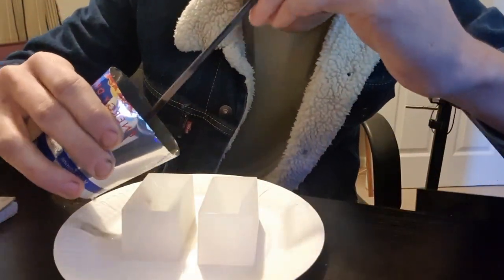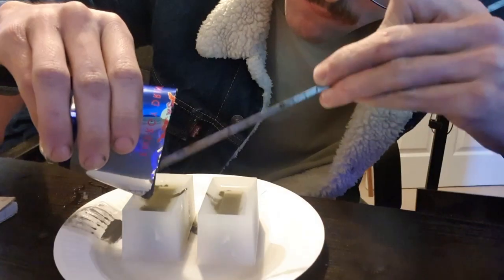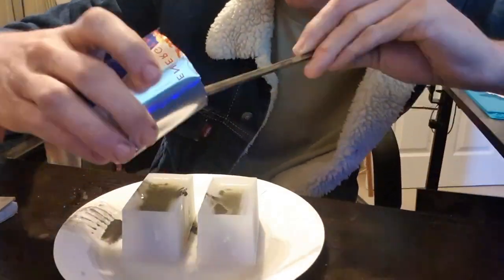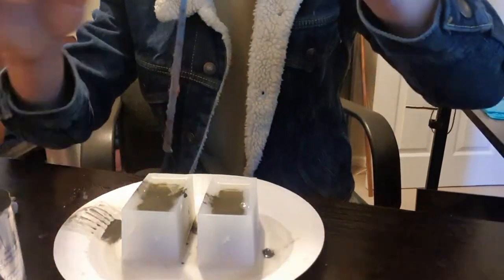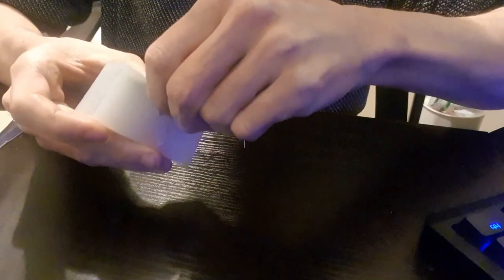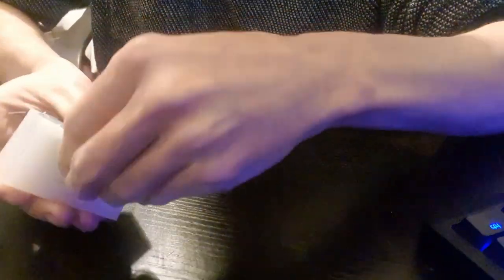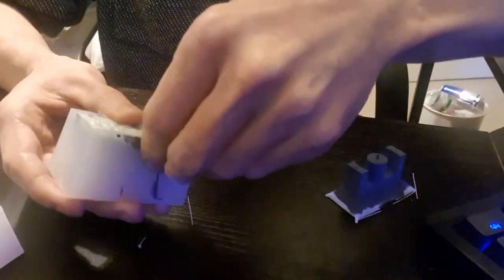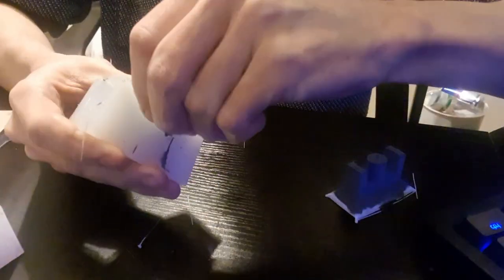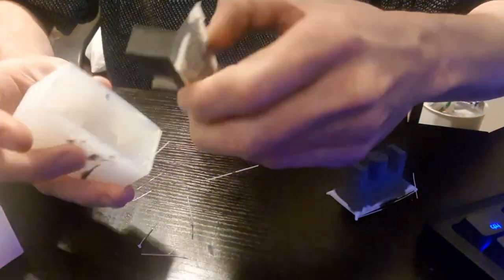To get it to settle, you'll want to tap the sides to get any air bubbles out — just do this for as long as you feel is necessary. I also found it's good to use a skinny screwdriver, put it into the actual part, and stir it around to ensure there are no voids, that it's filling all the areas, and any air bubbles come up. Then set it in a place where it won't be disturbed. It needs to cure for about a day or so before it can be pulled out of the mold. Once pulled out, it's still going to be a little bit soft, so leave it sitting for a few hours to finally cure and solidify, then sand off any extra material. And that should be your part.